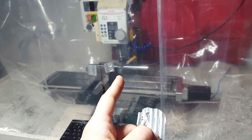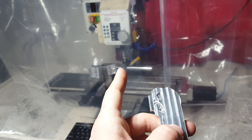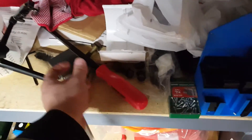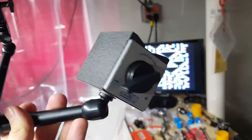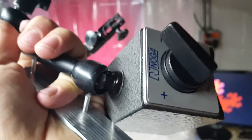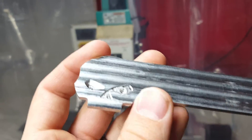What I was running into is the mill is not 100% tram. I was using a dial indicator in the collet, trying to tram it that way, but you're only sweeping that small a radius. Then I tried putting the test dial indicator in my Noga base, unscrewed it, stuck it in a 3/8 collet — it fit, but it was wobbling around and I still couldn't tram it right. So we're making a tramming bar now.